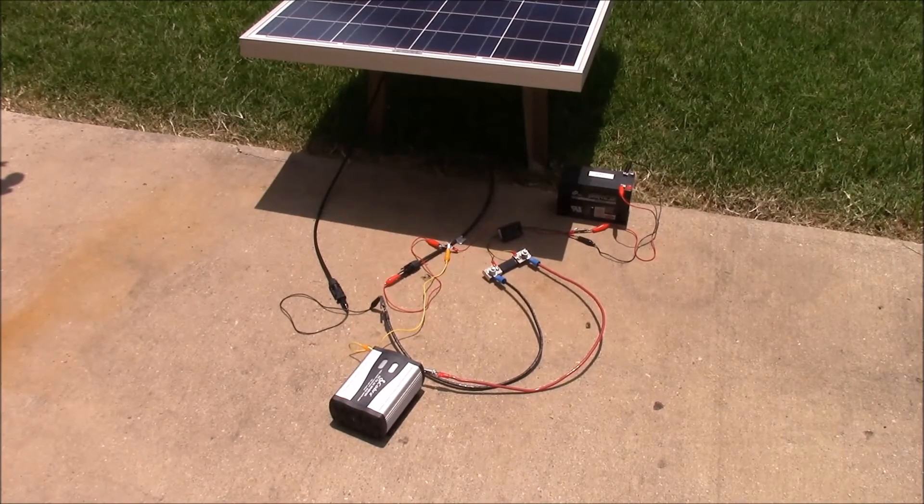I have seen other YouTube videos and heard of people doing it, and yeah, there are probably some inverters out there that will do this — but you're going to destroy your inverter. It's going to overheat, it's going to have to work too hard to convert that voltage, and it's just not a good idea. It's going to shorten the life of the device. Hopefully this has definitively shown you that you really do need a charge controller in your solar panel system, regardless of what you plan on doing with it. Thanks for watching.